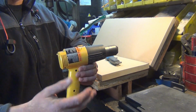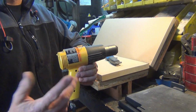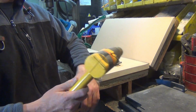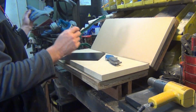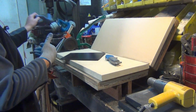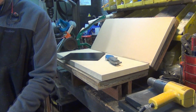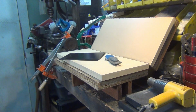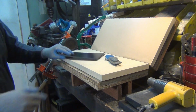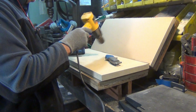As soon as it starts hardening up, it's just not going to press right, and then you're going to have to reheat it and repress it, and it's going to look kind of funky. So that's what I'm going to do right now. I'm going to put on my gloves because I'm going to be handling hot Kydex. I already turned on my heating tray, and it's getting warm, so I'll put this to the side and we'll just start heating this up.